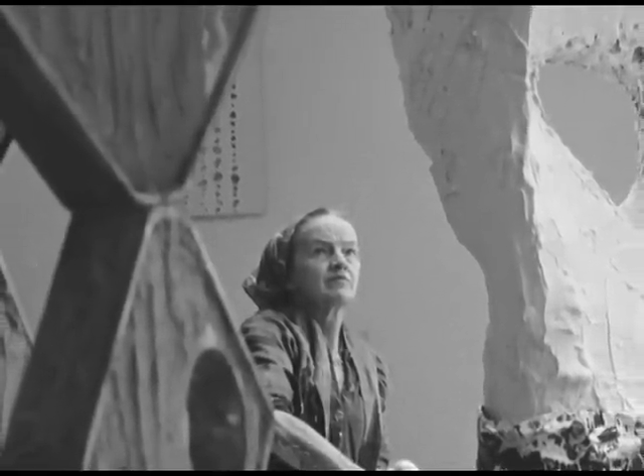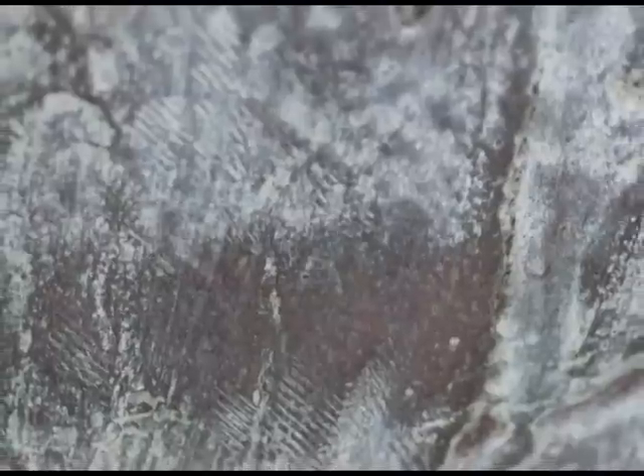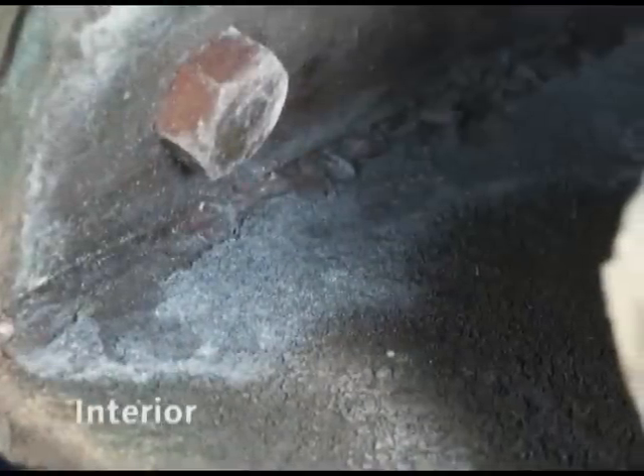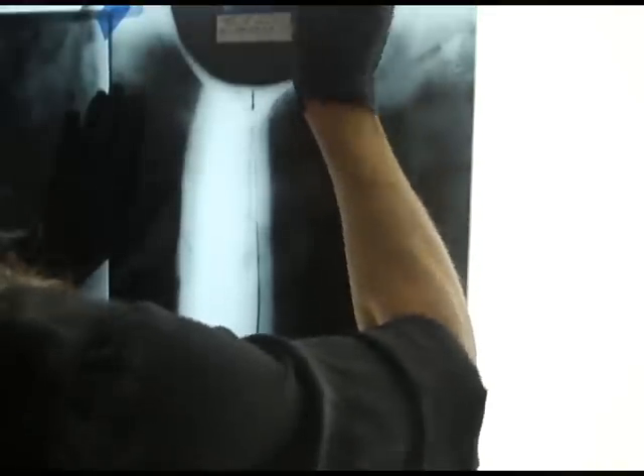Hepworth's method of carving and shaping plaster forms, with textures later cast into bronze, is well documented. These textures and marks of her working technique are evident on the surface of Figure for Landscape. A visual examination established that the piece had been sandcast, but other forms of analysis were needed to determine the structure and composition. Inductively coupled plasma spectroscopy and x-ray fluorescence spectroscopy were used to determine the alloys, which was a quaternary bronze. X-rays confirmed that the piece was cast in two vertical halves and then attached with both mechanical and hot metal joints.